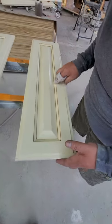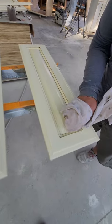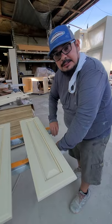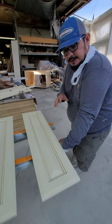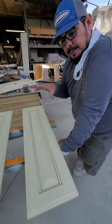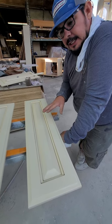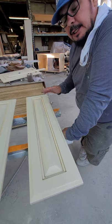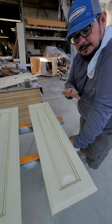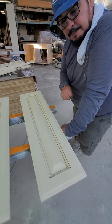Go back through, make sure it's clean, make sure there's nothing on the face of it - and pretty much we're there. This is the Renner breakaway glaze and I love this product. I did apply it in the breakaway mode but it was biting a little too hard to the door for what we were doing. On the bottom we used Renner 765 1K with a catalyst to make it nice and hard. Now we did our patina and after that we're going to run our 851 top coat on top.